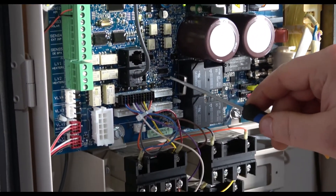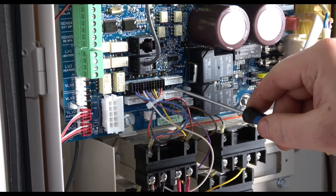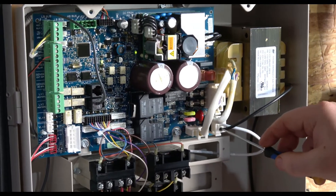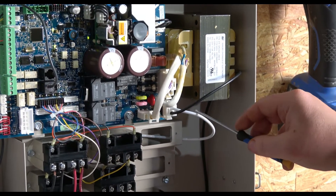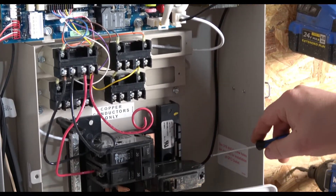If you add any relays, you can add a fifth and sixth relay — the Omni calls these out as HV9 and HV10. The last thing worth pointing out is where the high voltage connection goes for the Omni itself. You've got a black wire and a white wire: the white wire ties to the neutral bar, and the black wire ties to the circuit breaker to give power to the Omni.